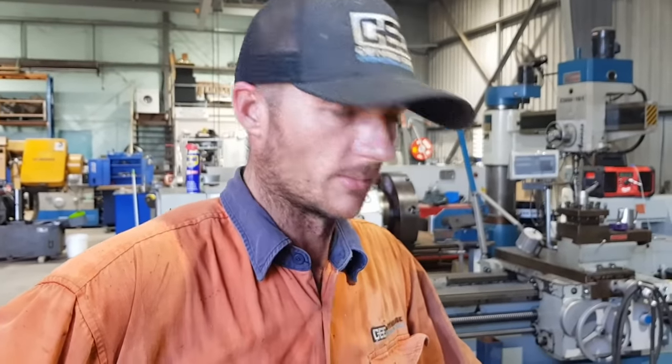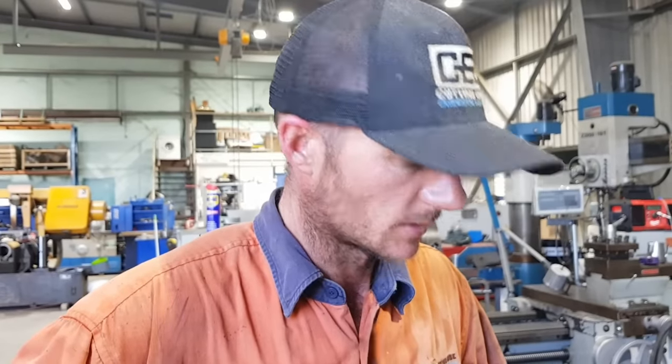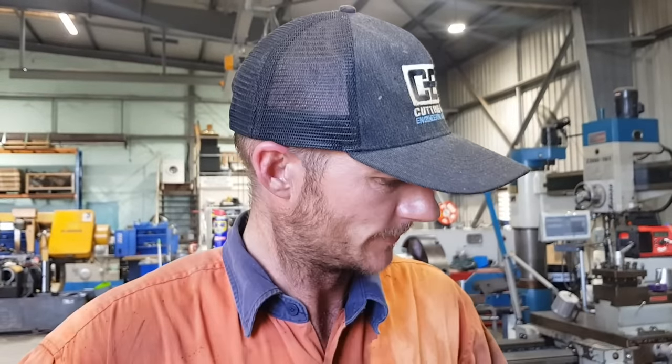So the process for fixing this one is remove these three broken bolts, reclaim each face, put about 9 kilos of weld in there, should be enough, and bore it all back out before Monday morning. And it is 5 o'clock Saturday afternoon. Good times.